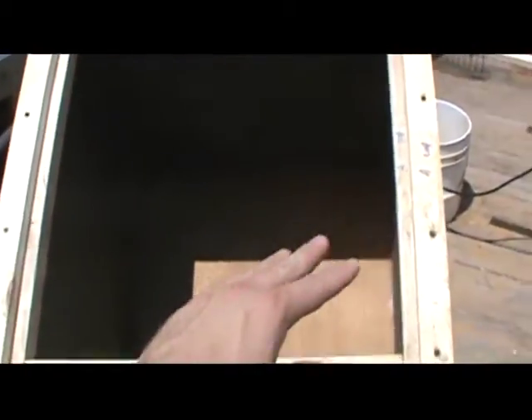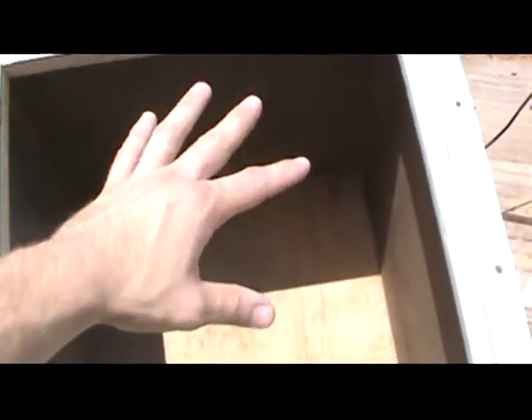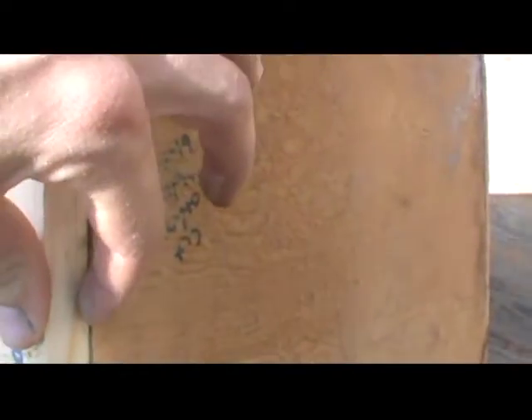After that we'll do the paint work on the inside of this. We might put some insulation and tile in later, but for today we're just going to do the paint work and see what temperature the box will get up to. We've also got the trim around the box so the glass can set in. Now I'm going to take some one by two trim and go all the way around the outside of the box just below the lip — that will hold the solar covering that goes around it.